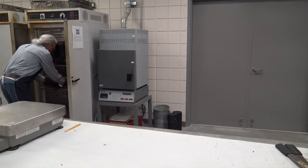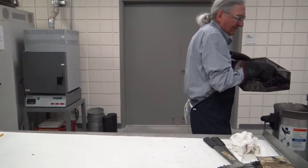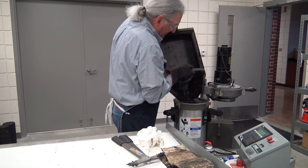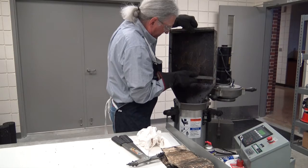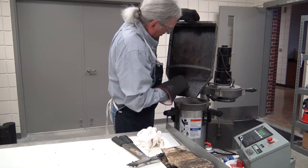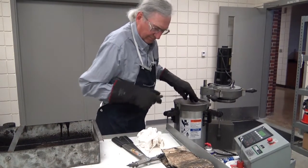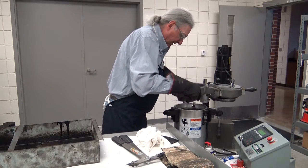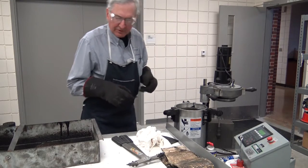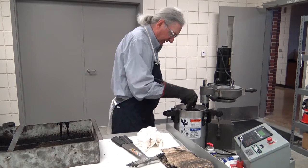I have a sample here; it's at 275 degrees. And just pour this into the mold. If you remember, we weighed up approximately 4,700 grams of material. Usually when you pour it in like that, it's all kind of laying against one side of the mold. I'm just going to level it out a little bit in the mold — we're not trying to do any compaction here, just level it.